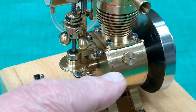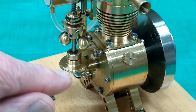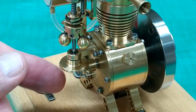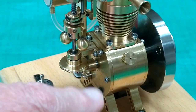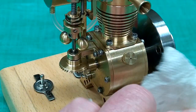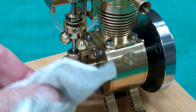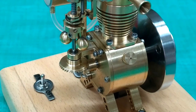It is human nature to want to reach out and touch something that's spinning or running, and that would be a real bad idea around this gear set. This is real sharp — it will tear the heck out of your finger, and these things throw oil all over the place. If you're trying to mop up oil while it's running, that can get caught in there and do some damage. So be aware of that and keep your eye on people when they're around this while it's running.